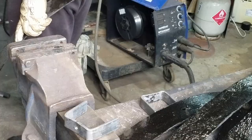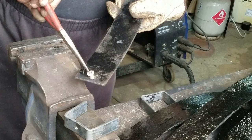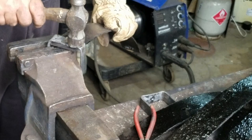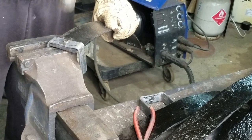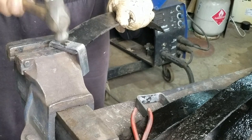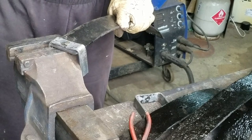Quickly whip them out. This was the practice one — I'm not particularly sorted yet, but get it through the hole, turn it over, put the strap over it and give it a knock just to get it down. The first thing you do is upset the rivet — not by talking to it in a mean way, but by giving it some really good hefty whacks straight down on the top. That makes it fat and makes it fit the hole. Then you turn the hammer over and use the ball-peen end, which puts a nice mushroom rounded finish on the rivet. That's the first one — we'll call that the warm-up.